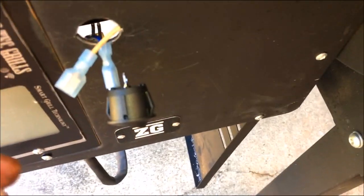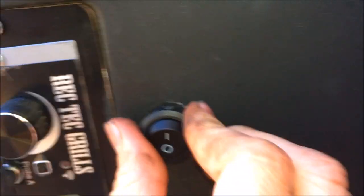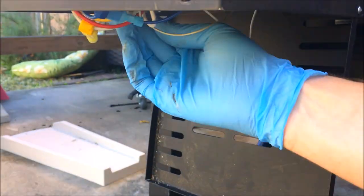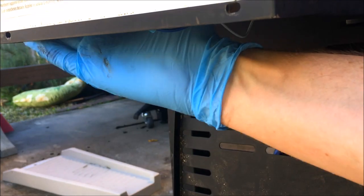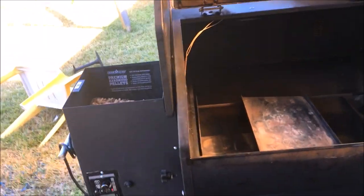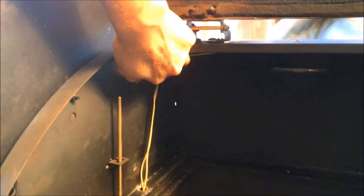Once plugged in we'll have made all of our electrical connections and we'll be ready to push it into place. I even got it in the correct orientation this time. Now that all the electrical connections are made and the switch is pushed into place, it's time to tuck the wires in. When tucking the wires in make sure to avoid any of the fan blades in there. I always aim for the back left corner as it seems to have the most space away from the fans. Electrically I know the wiring is sound and it should work, but this is actually the very first time I'm going to try turning on the light. Fingers crossed.